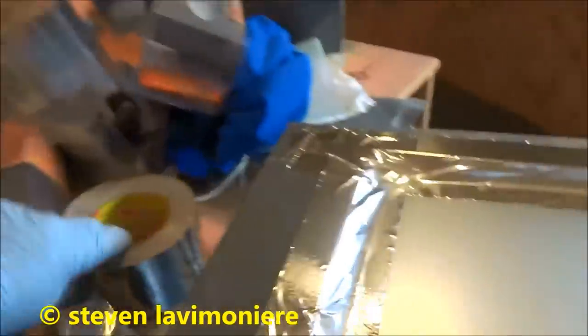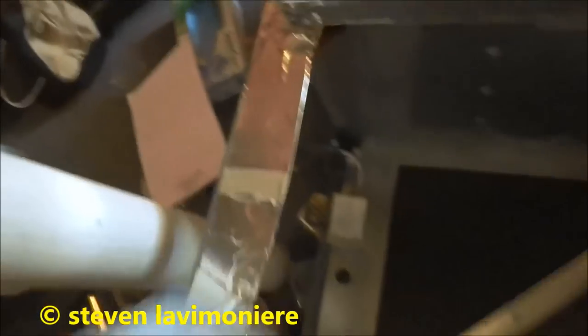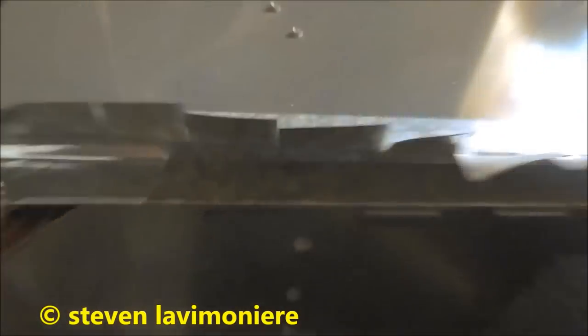I got the bottom all taped up with good silver tape — it's got the paper on the back, good stuff. I also got the return in, put a couple of screws in there. I like to put tape over the screws so you can slide the filter in. I'll put the unit in, then I gotta bend these tabs over — I'll crawl inside once the furnace is in and bend the tabs over to connect this to the duct. The filter goes right in. It only comes up about 34 inches, so I got to pan in about 12 inches.